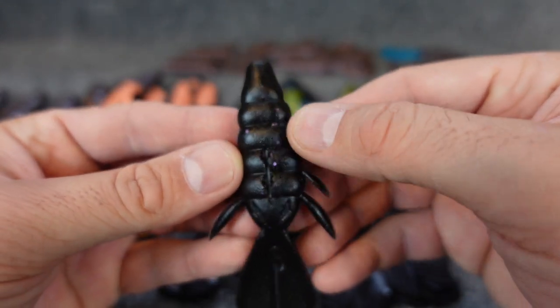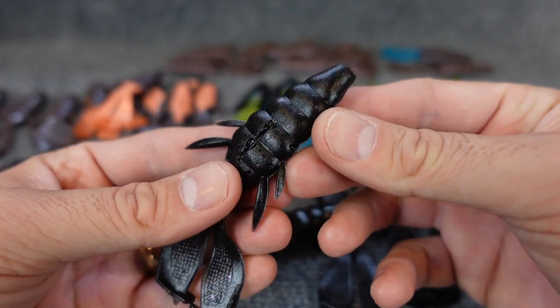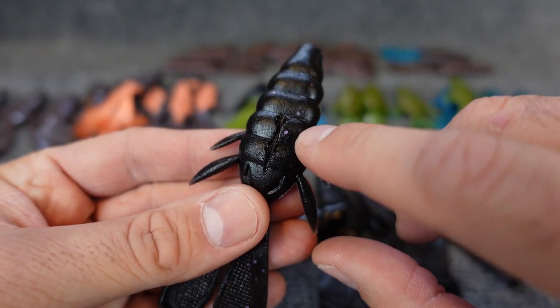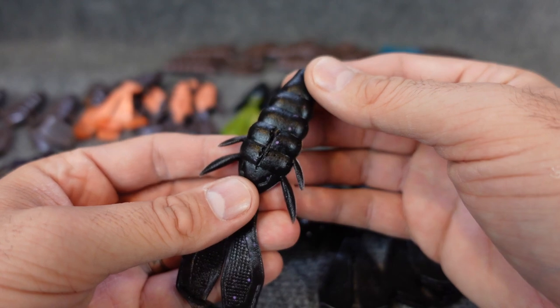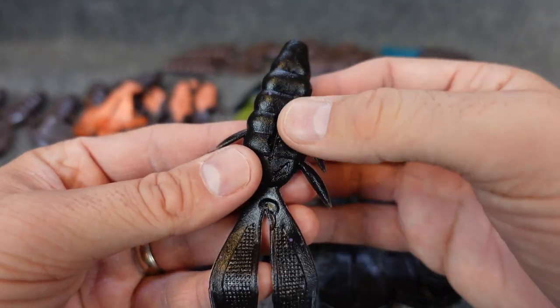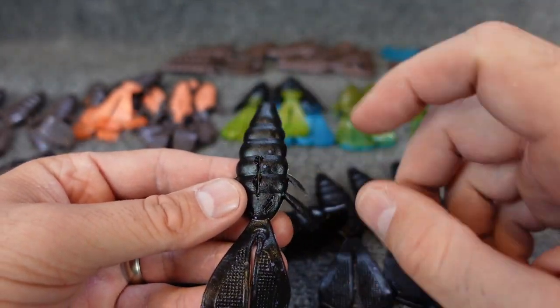You can see there it's got, you know, all the imperfections from the sand cast mold, which I think actually looks more lifelike. Now, the one thing I did notice that on the sand cast, always around like the hook slot here, it didn't want to completely shoot there all the time and fill in. It's not an issue to me. Your hook's still going to fit down in that slot, and I think a 4-aught hook is perfect if you're throwing this on a Texas rig.